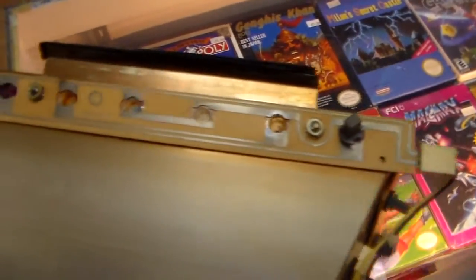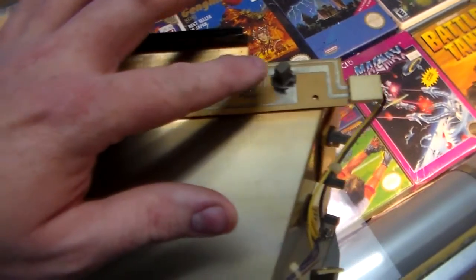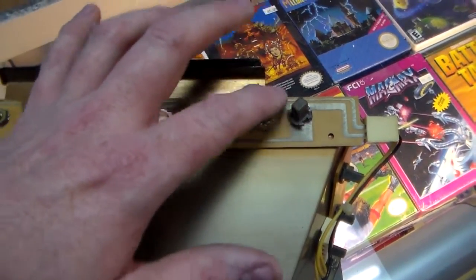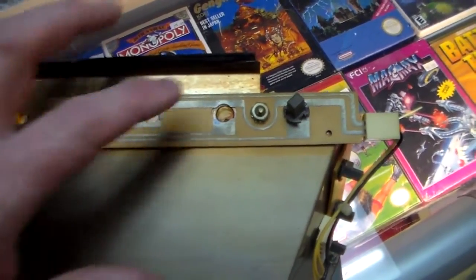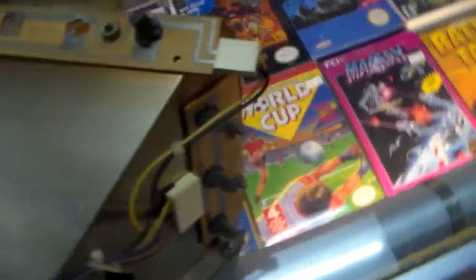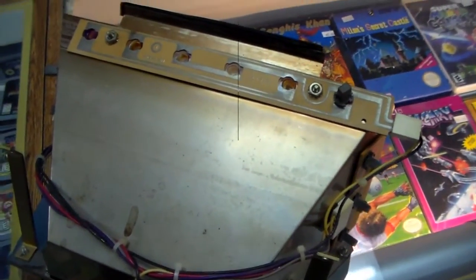What we're going to do is first fix up all of those connectors — I'm going to clean these contacts to make sure they make good contact — then twist our new ones in. I'm actually going to check the continuity from this side to that side to make sure I'm getting the same reading as the bulb. I've already checked these new bulbs: 15 ohms resistance. With the holder in I should get 15 ohms, letting me know it's making good contact. Once I get all three boards rigged up with the right stuff and right bulbs, we'll put it back in and see what happens.